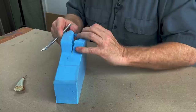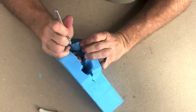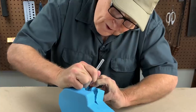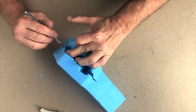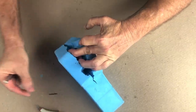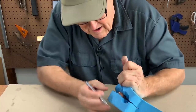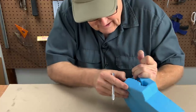People wonder how you deal with holes in a mold like the armhole. Can you see that bridge of rubber stretching across? We pull it out on one side, come in, and we just cut it. Because it's stretched, we're actually cutting much closer to the middle of it than you would think — we stretch the rubber to facilitate the cut. Now I want to cut down this vent right there. I found it perfect — cut down this vent perfectly, as I knew where it was and headed towards it.